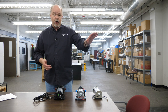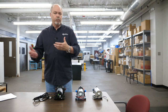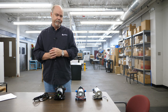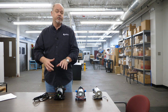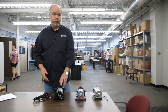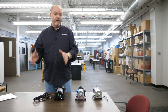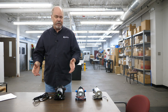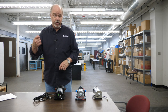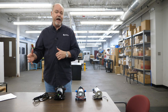When you go to the faucet and turn it on, that creates the demand. Pressure drops in the system and the pump senses that pressure drop and turns on. A demand pump can also function as a delivery pump if you activate it with a switch rather than letting the built-in pressure switch operate it. A delivery pump is the same pump without the pressure switch — activated simply by turning a switch on and off.